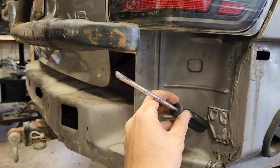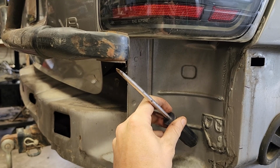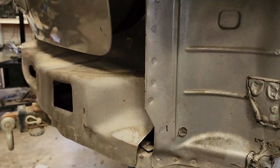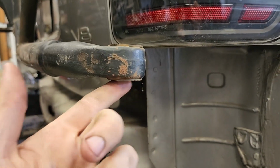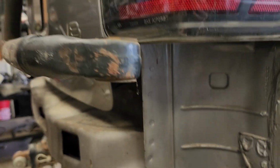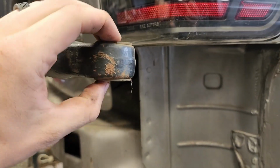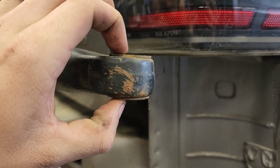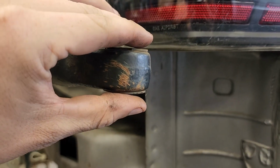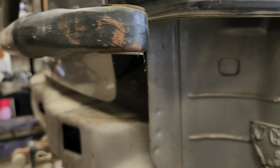off of that we're going to do some sort of reinforcement brackets this way to come out to the spindle, and I want a C shape over the spindle so that it's got top and bottom contact. I'm going to grease it on both areas and put washers and everything. I wanted to find some roller bearings to put in here, but then I think that'll just be an extra point of failure. So the collar that goes in the middle is going to actually just be a little bit taller so that when I tighten the nuts down, it's not actually squeezing this bushing. It's just right above it.